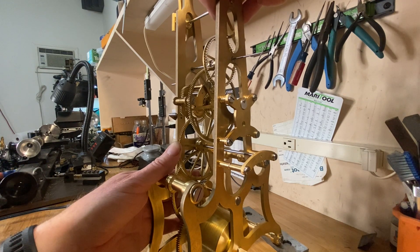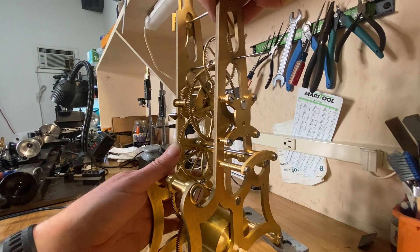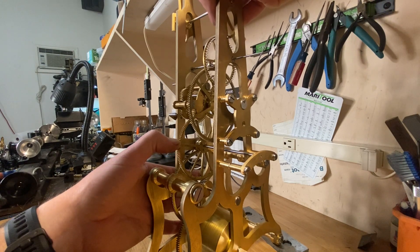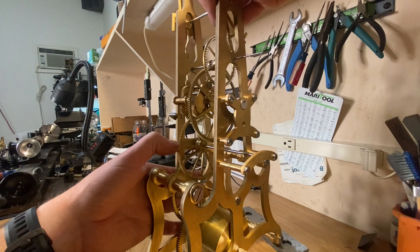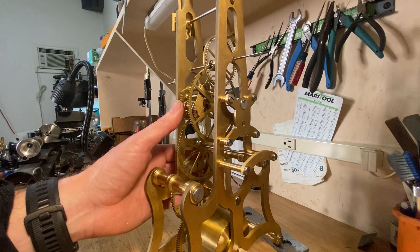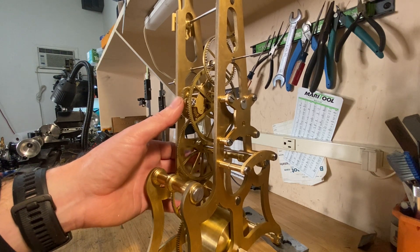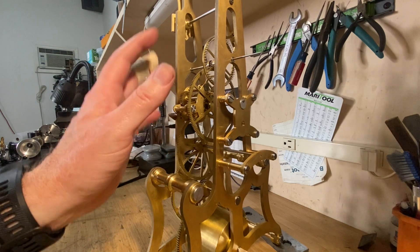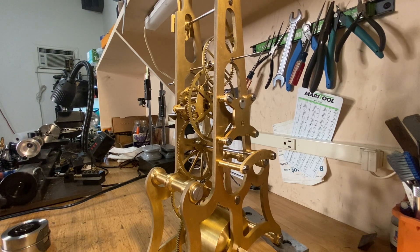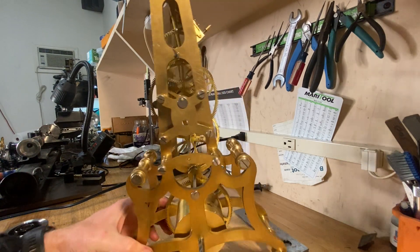You can see it'll tick down, and over a period of time, once it ticks all the way down, there's a mechanism that releases the escape wheel, and this will jump back up. So it'll have this kind of odd periodic motion. The nice thing is the only thing driving the pendulum is the weight of this mechanism right here — it basically decouples the mainspring from the escape wheel. Through gravity it's the drive, so it's not the most accurate clock, but it gives an interesting motion.